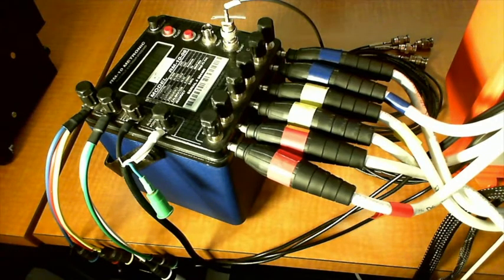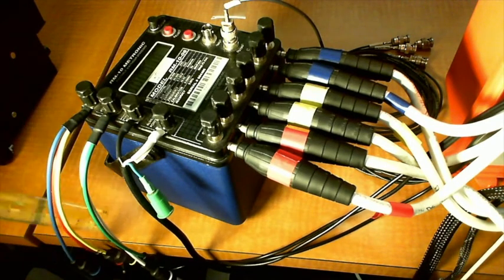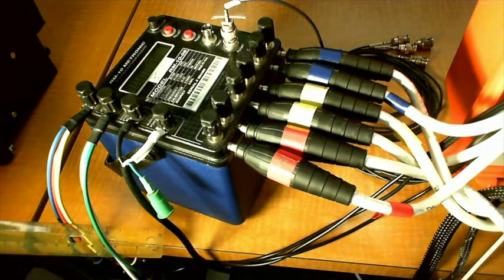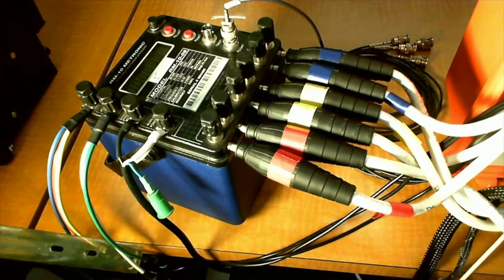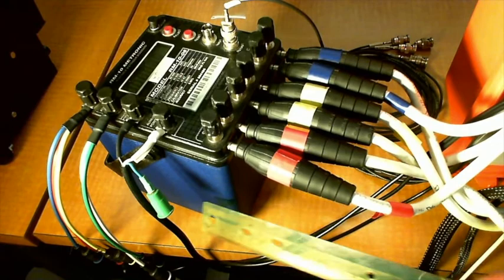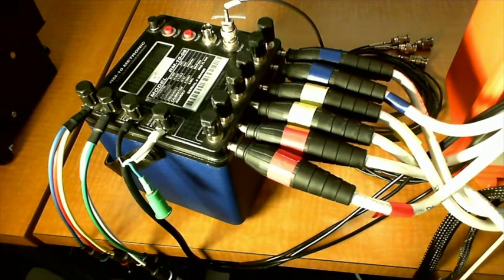If you can see, I've got my voltages here, which is actually a jumper that we sell that you will need. You will also need this neutral to ground, which I don't have the ground hooked up, but you will need the neutral hooked up. And of course you will need the AC going to your standard. Again, guys, you need to make sure that your standard is at least 4 times better than the piece of equipment that you're testing.